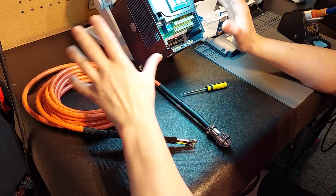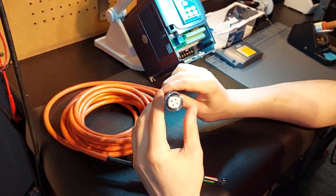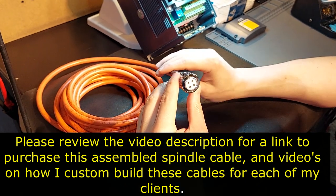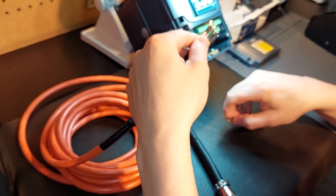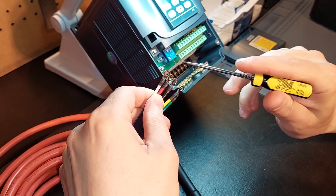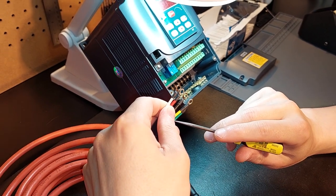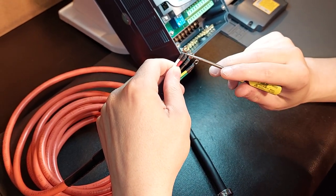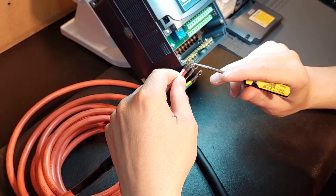In this portion of the video we're looking at practical application. I've got an HY 2.2k VFD and a pre-made DS Flexion 20-foot spindle cable assembled with a large white HY connector — many of you have seen this connector, it's used on both 1.5 kilowatt and 2.2 kilowatt spindles. My connectors actually have the ground symbol on them. You can see on our ring terminals here for the spindle cable — just fanned them out — we've got white, red, and black, then a yellow with green stripe, and also a silicone lead which is an extension of the shield drain.